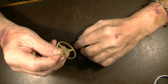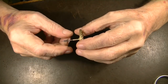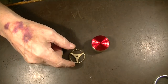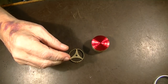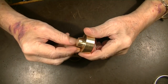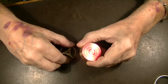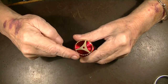Tonight we're going to make this. It's called a crown wheel. It goes on an arbor like that. And we're going to make it out of this — a piece of 360 brass. I've already cut the blank down. I cut the back here to three quarters of an inch so that I can put it in a collet. Three quarters of an inch is the biggest collet I have, and we'll put it in the lathe and turn this down.